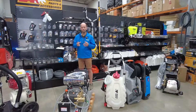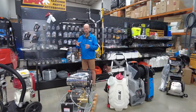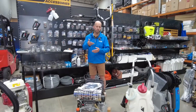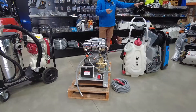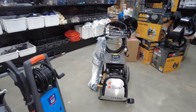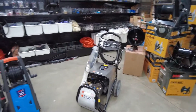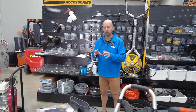Welcome. I wanted to discuss something that I've come across time and time again with people that own pressure cleaning systems and equipment: nozzle size and performance. When you go to buy a piece of additional equipment, all these systems operate with an unloader valve and a performance factor that is determined and controlled by the nozzle size in regards to the specifications needed to meet that machine's performance.